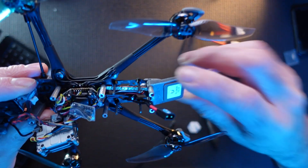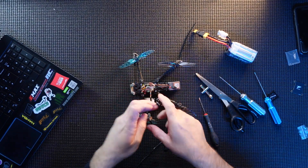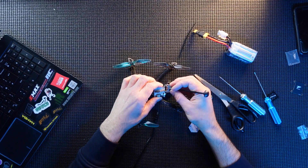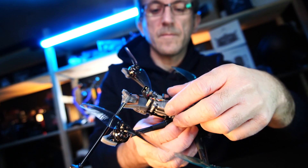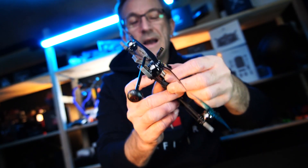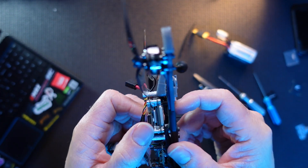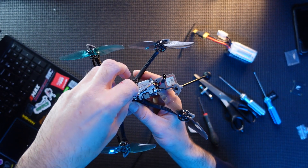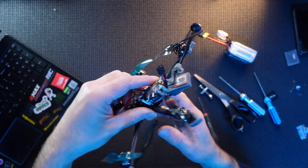If you can see that - all I've done is put the zip tie so it keeps the power cable over on this side, out of the way as much as possible. It should still sit flat - yes, still sits flat, that's fine. It should be fine. Cable on the top, I've zip tied the power cord out the way. You can see it's got room to actually breathe now. I think I had all the cables just resting on each other which was probably a little bit bad. I've moved the Caddx Vista cable on top, zip tied the power cable at the bottom, and just separated it from the actual GPS unit cables.